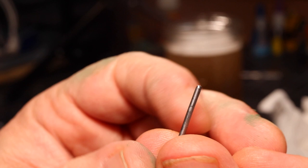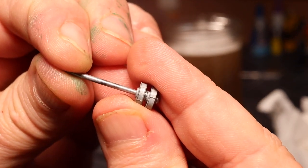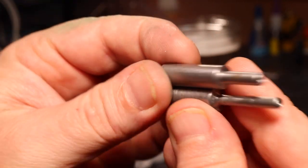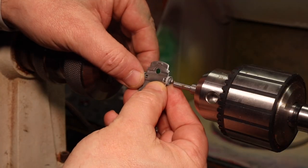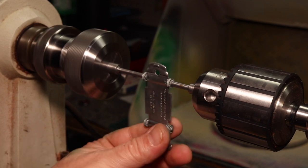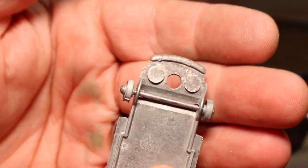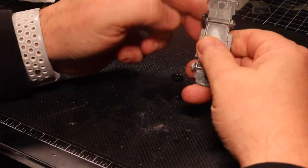Moving on to the axles. If you are familiar with Matchbox, you know that in order to remove the wheels and axles you need to grind or cut one side of that little mushroom off to remove them from the base. Luckily, Bare Metal Hot Wheels sent me this tool that goes into a lathe. If you aren't familiar with Bare Metal, you should be — he's got way more subscribers, awesome content, and I'll link him in the description below. Now I don't have a metal lathe, but I do have a wood lathe. I can put each of the pieces in a chuck and the friction will hold it in place, then I can spin that mushroom onto the axle. The tires are from yet another Matchbox casting — I believe it was a Mustang — but they fit just fine.